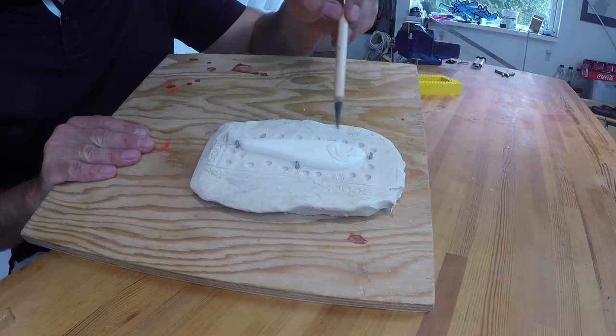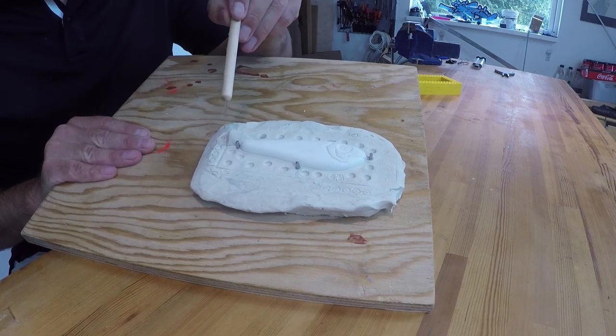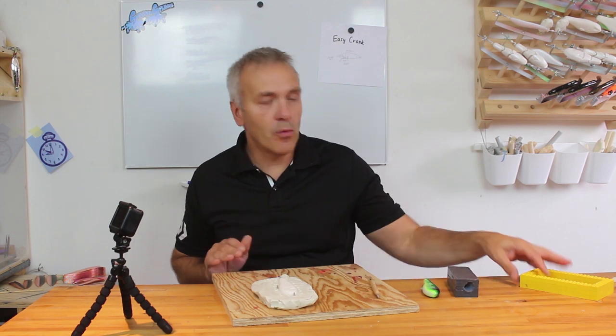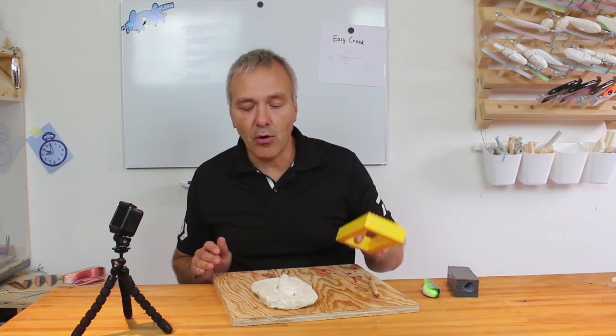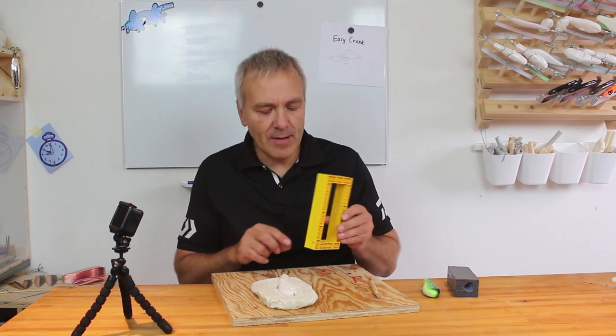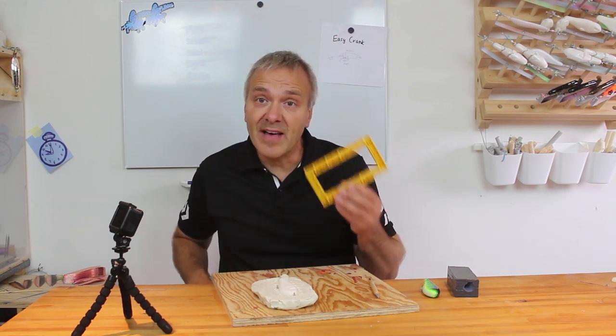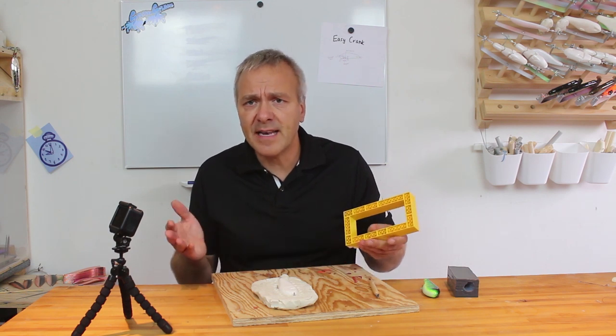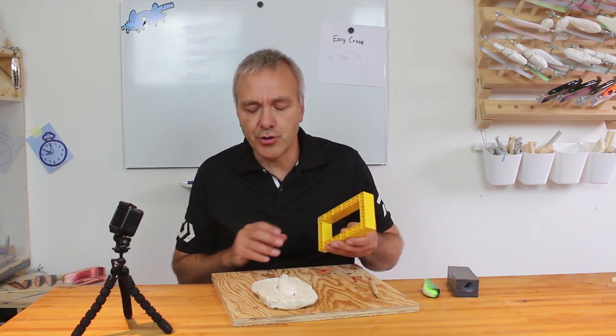Apart from that, there's nothing special. I've had the steering holes for the two parts here, and I have the funnel up here. And as always, I've made a frame in Lego. So now I'll just grease up the frame with some Vaseline, push it into the modeling clay, and cast the first half. That is more or less business as usual.